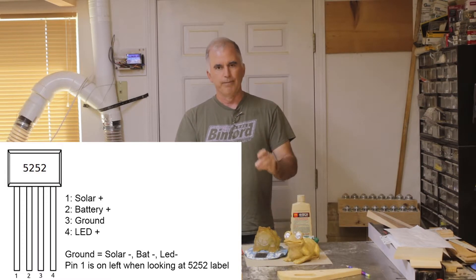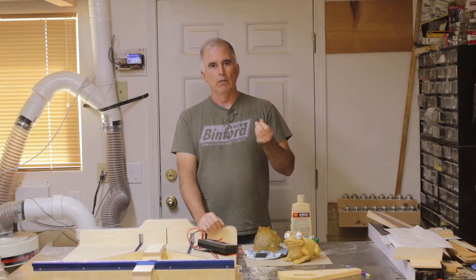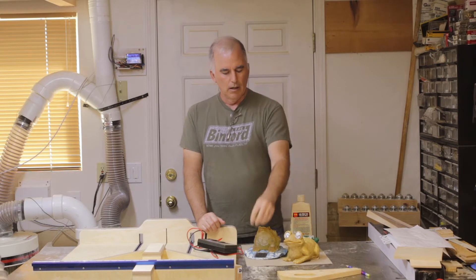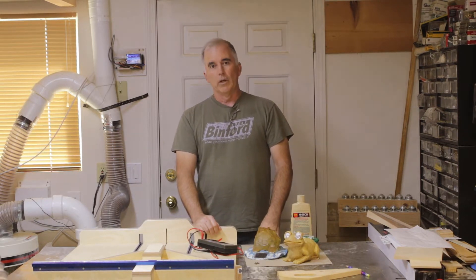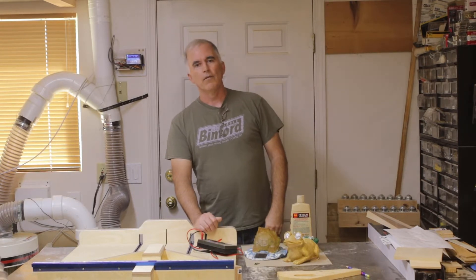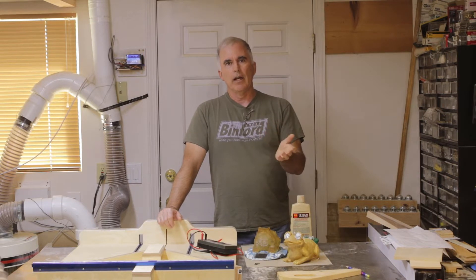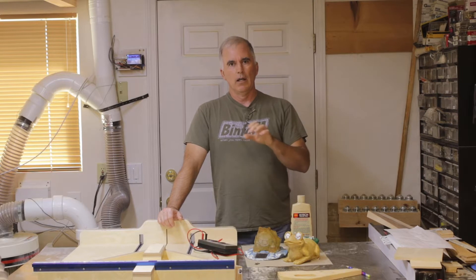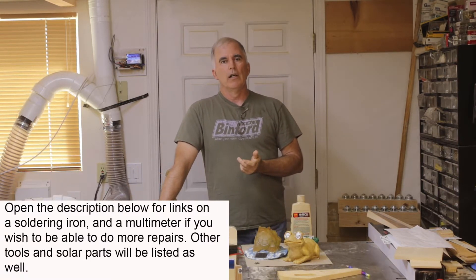If it's not a 5252 — that's the most common I've seen — I'm not really sure what to do, but I'll have a video coming out in a few months showing how to build one of these from scratch. This one that was so bad, I completely rebuilt it and put all new insides in the little black box, using the same solar panel and same LED, but the circuit board and battery were completely rusted and useless because the box was just full of water. If the battery clips have rusted so badly you can't fix them, you can remove that part and solder your battery in directly if you have a soldering iron.